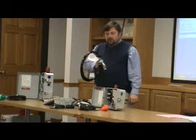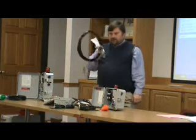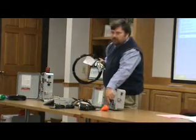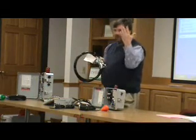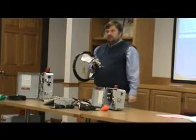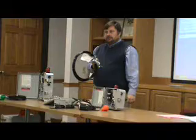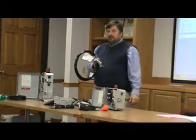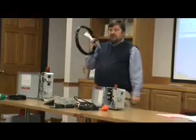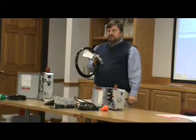So as a rule of thumb, I tell all my engineers, if you stick one of these in a panel, stick 2 of these to back it up. Because if this fails, that'll give you a high water alarm or your low level cutoff to stop your pump from running. So the other benefit is price. A float switch is $20. These usually are in the range of $800 if they go bad. Well, that's set.